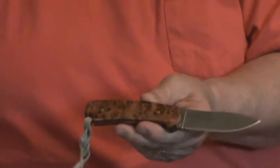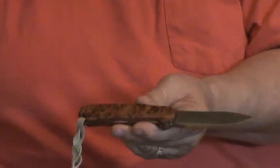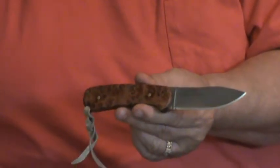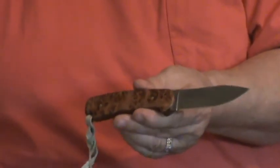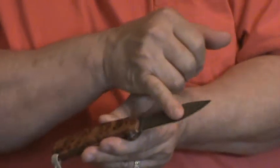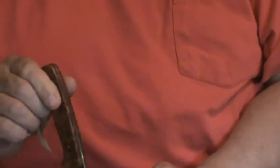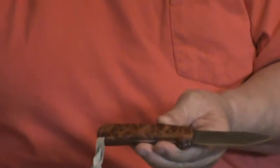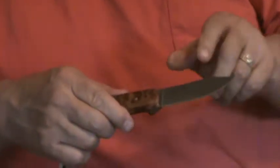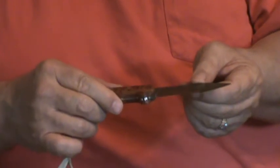Because of that small size, it does a couple of things. Number one, it makes the edge extremely hard — these Rockwell between 65 and 68, with 65-66 being the average; I've seen them up to 67. The other thing it does is it seems to trap the chromium carbides in the edge area, and it's just totally stainless. I've seen one of these at the blade show dumped in salt water as a demonstration — they had it in there for quite a few days prior to the show. The soft D2 back on the spine had a little bit of pitting and corrosion, but there was nothing on the part that had been friction forged. It was just totally stainless, so you won't have any edge degradation just from sitting around.